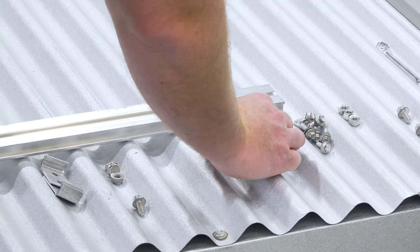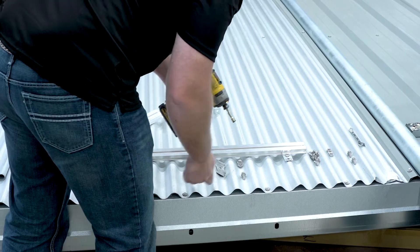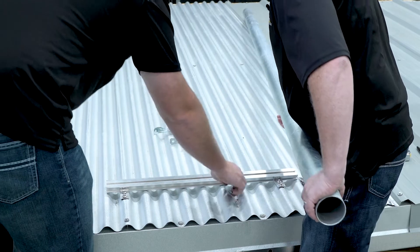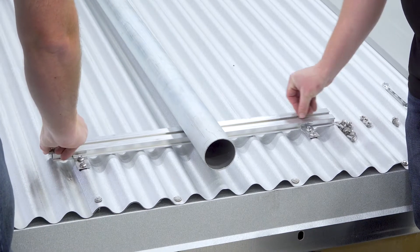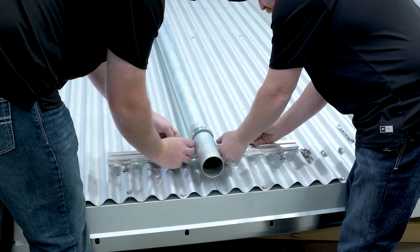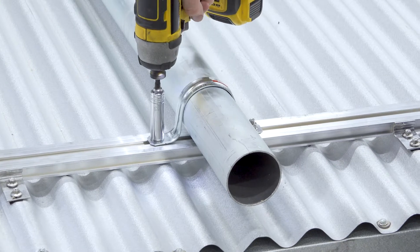Get her all lined up. Something else to point out is you could cut this piece in half because it is quite large for what we're doing. If you had multiple runs you needed to run — like when doing a solar job — you could run multiple pipes across this for all your home runs on solar. We'll go ahead and bring our pipe into place. We can run these bolts in here like a stud, drop our clamp over it, get one side on, start our nuts, and tighten with the same impact and socket.